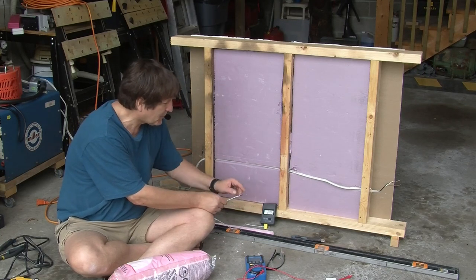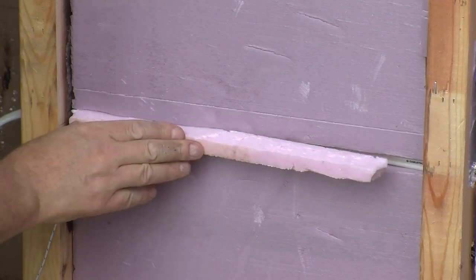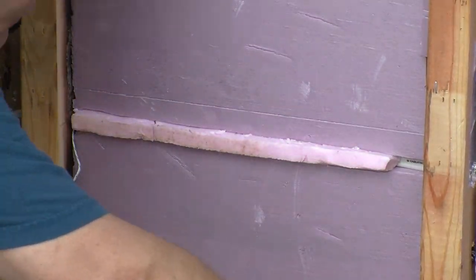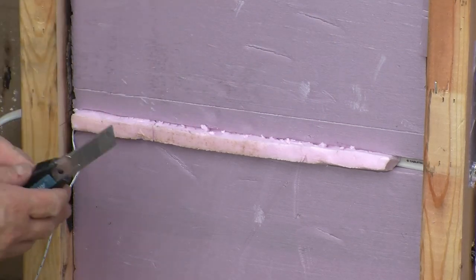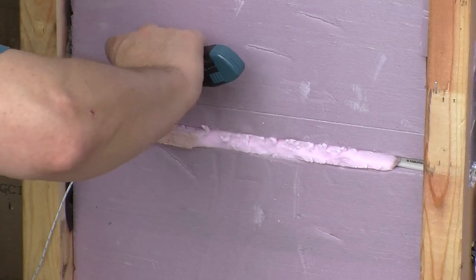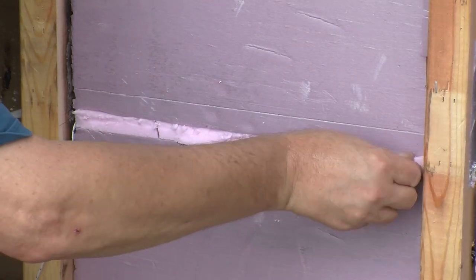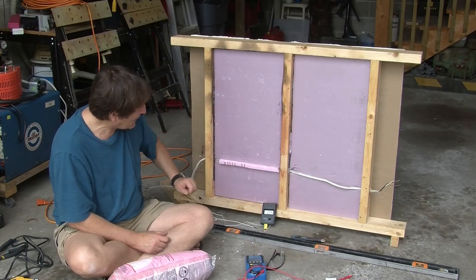I have this little thermocouple and we're going to embed it in the channel next to the wire and then cover it up with a piece of foam insulation. The reason we're going to do that is that's what a very attentive homeowner might do to make sure they have the best possible insulation. It also sets up the worst-case scenario for our wire, which is now going to have all of the heat it produces confined in all four directions by a layer of foam.